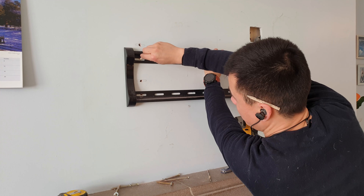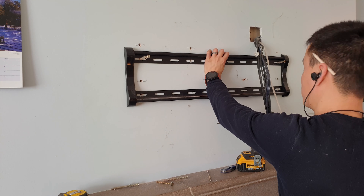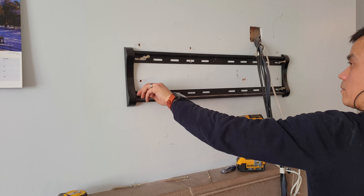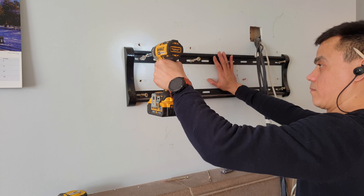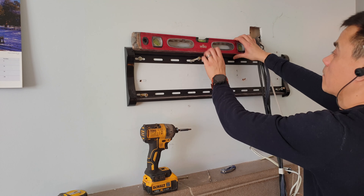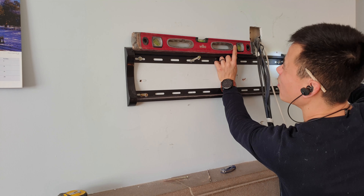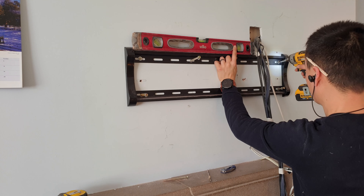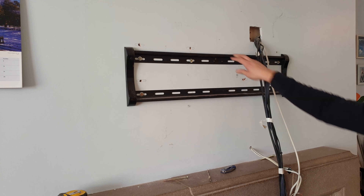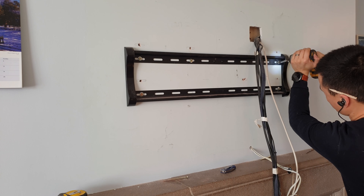Bracket back on the wall — I'm just going to loosely finger-tighten some of those concrete screws into the wall. I will put a link for those screws in the description if anybody wants any. Next I'll use my impact driver just to nip up one of those screws, get the spirit level on top, level up the bracket, and then secure the rest of the screws. Gently feel around the bracket when those screws are all nipped up — you can feel that the bracket is secure and in place and it's not going to come away from the wall.